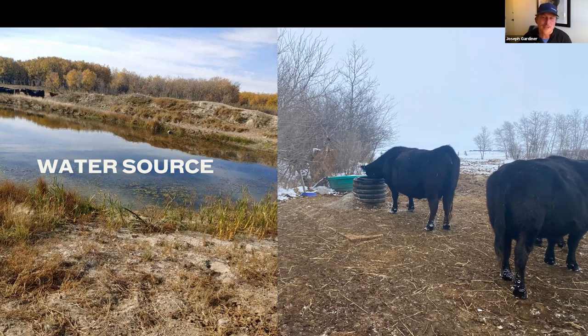Phil describes System 1: an electric eye with a level wet well underneath it, with pumps below. You could run this system from electricity in a yard if you wanted to set it up. In their particular case, they run it off a dugout with a wet well, fed by a pipe from the dugout. One thing to consider: you need enough depth in your dugout so it doesn't freeze to the bottom in winter.